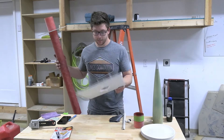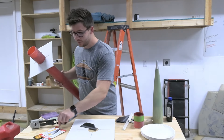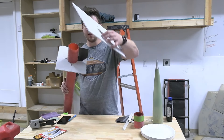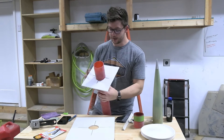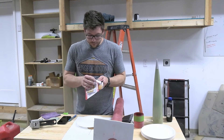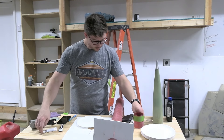We're going to try to tack all these fins on at the same time. I have two foam guides with marks where the fins need to go. I'm going to use JB Quick — the quick-dry JB Weld — to tack these on. We'll put some on the root of the fin and slide it into the guide so it holds them all. Before it cures I'll slide that piece on to make sure everything is in perfect alignment, or close enough. We're using foam board templates so nothing's perfect.